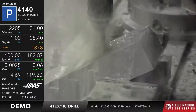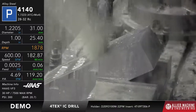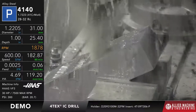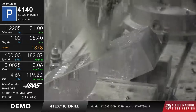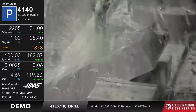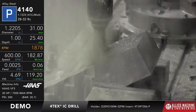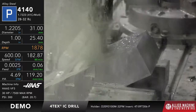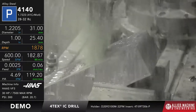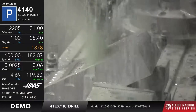It's going to be in the interruption now through the entire cut because we're cutting out the material in between the two holes. Once again, we're still running 600 surface feet a minute, 2.5 thou per rev, which equates metrically to 183 meters a minute, 0.06 millimeters per revolution. This one never gets quiet because we're never doing a full engagement cut — we're cutting out that material in between. Here comes the fifth hole in that plunge cut, and this will be the last one of those. It's quite noisy, but remember we're going into a 30 degree incline and never fully engaging in the cut, so it's roughing things up a little bit — but it's designed to take it and does a pretty good job of it.